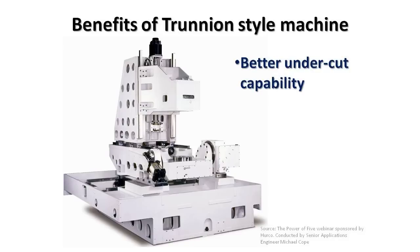This gives the ability to reach up underneath a flange, underneath the edge of a part, or get that angled hole that may point down towards the table in some manner. Another benefit would be a larger work volume. With the part being rotated underneath the spindle, and with the Z-axis and spindle always being vertical, once that part is rotated into position and clamped, we then have the full travel of the machine in X and Y to use in the machining envelope.